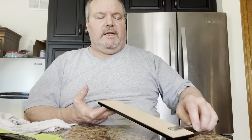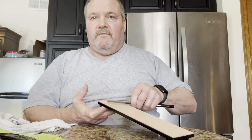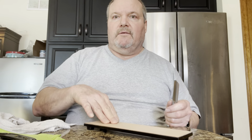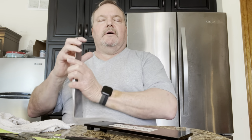And I have no real idea, since I'm not working off of flattened gear, whether I'm actually contacting the edge. But as I understand it from the grinder's handbooks, since you're starting off curving away and hollowing the bevel, it's more likely that when you get to an end point like that and you're finishing, you're actually able to make contact with it.